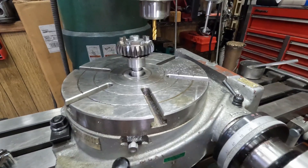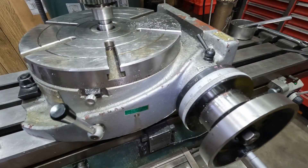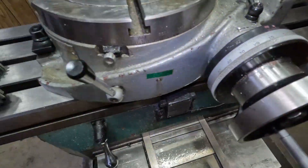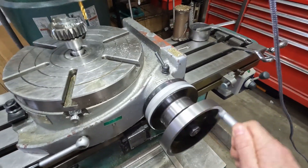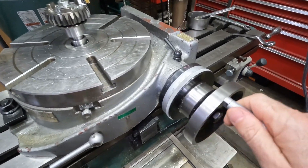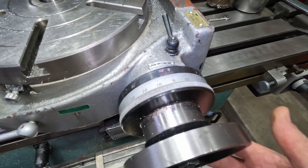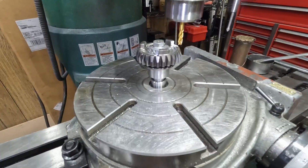Before we fire a motor up, I'll go ahead and index the next one. This worm gear is 90 to 1, so we'll just need 30 even spins. Got a nice zero set on the top there. Take the lock off and we'll just count this out. That's 29 — watch those come back around. Set your lock again, now you can turn the motor on.